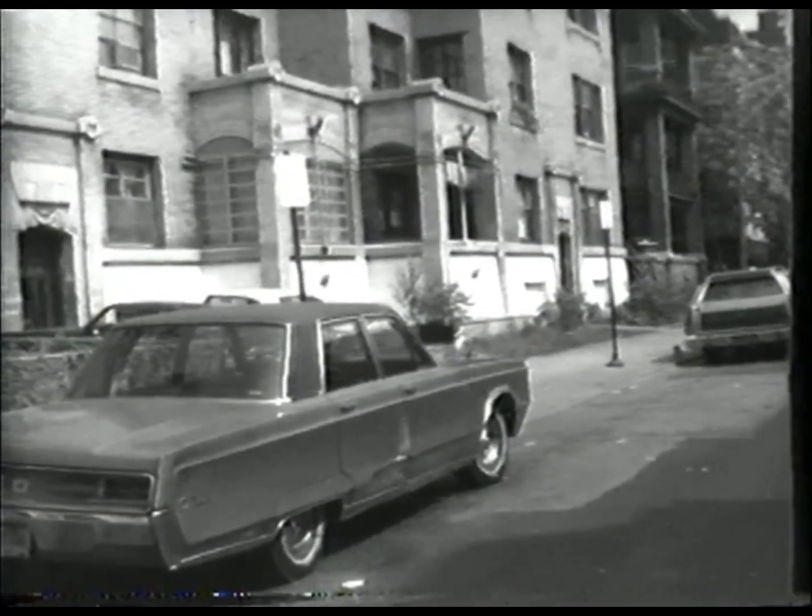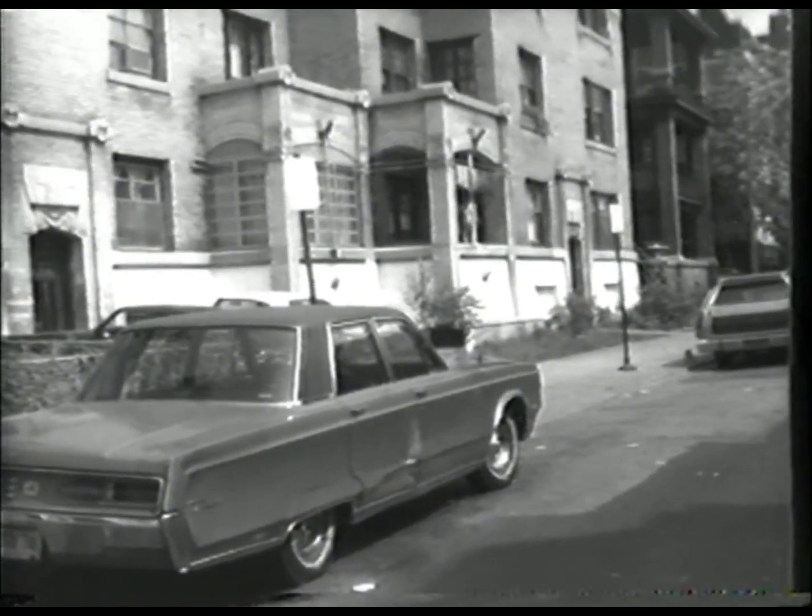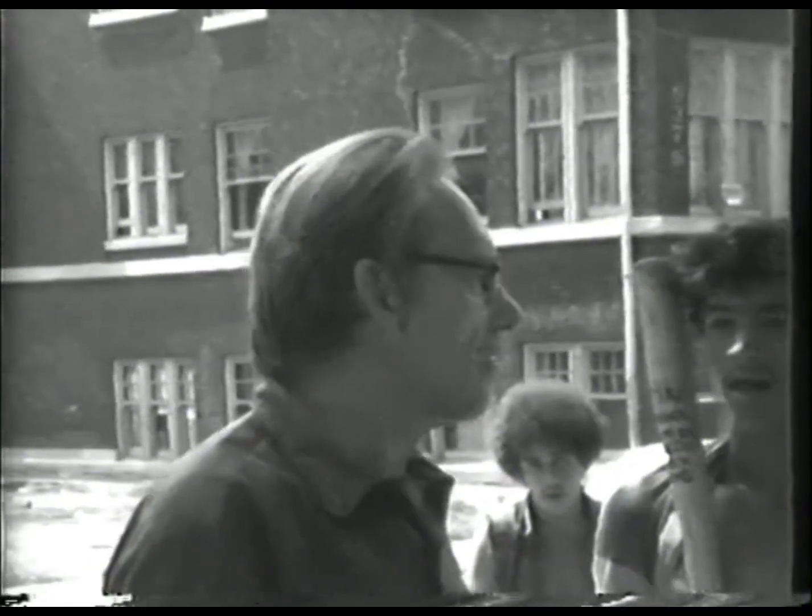Yeah, right. This is where he took it off, the blue. There's a good spot to experiment around. He took off the graffiti, but it left the marks of the sandblast, so that to commercially do it, you'd have to have a large outfit. This is sort of a home craft outfit that we've got. Well, we can get 100 pounds. It doesn't spray that wide a nozzle. And we tried it on a section of it, but it took an hour and 20 minutes for something like 21 square feet. So there's 440 some odd there. You can figure out what it would take.